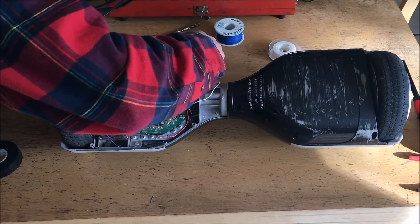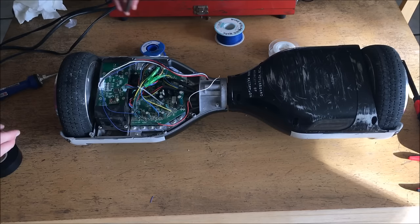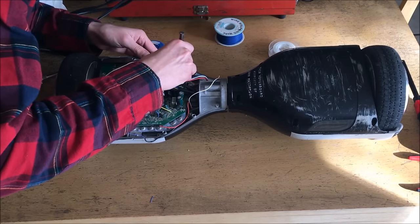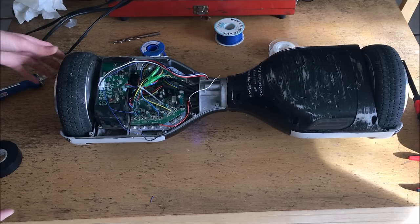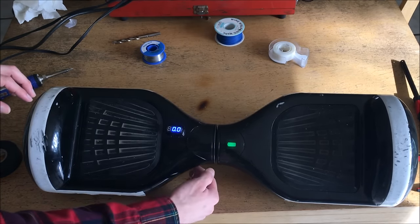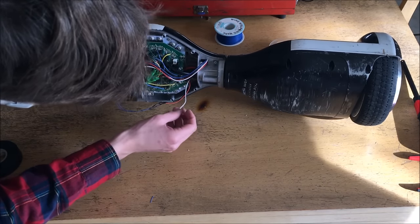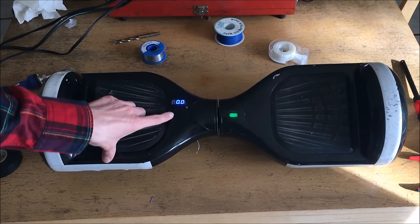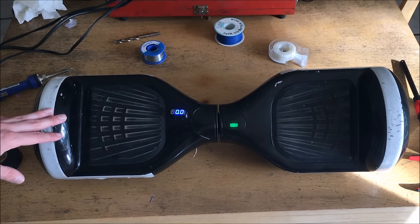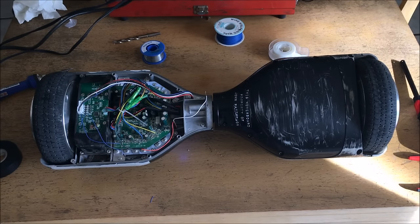Now to test to see if our solution is going to work properly, I'm going to power it on and see if the voltage display lights up. There may be a problem because it's not starting — when I try to short the two pins out to start it, it just makes a click sound. Oh, there it goes, I guess I just wasn't holding it down long enough. Now the moment of truth — yes, the display is working. We have 0.0 volts showing up. Now if I connect this other wire to something that has voltage, it's safe to assume that this thing is performing as it's intended to. So we'll move on to the next step, which is installation of the power bond for the output buck converter supply.